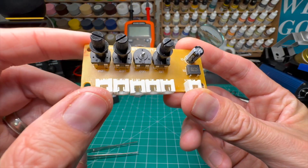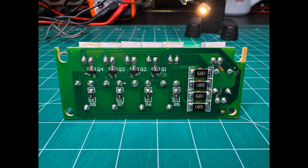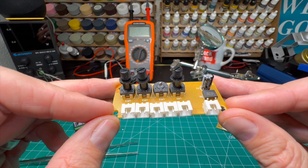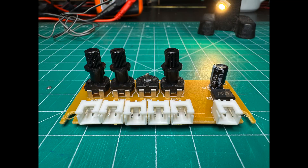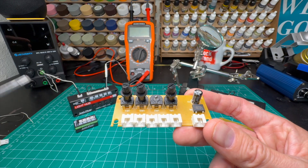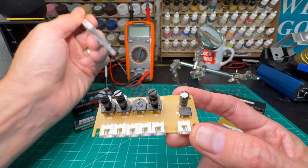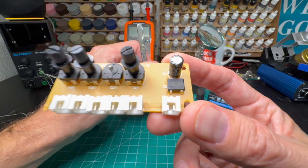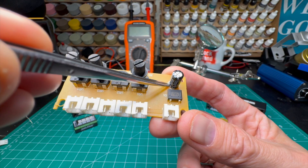Here's a look at the interior of a light hub. As you can see, this is a much more interesting board than that extremely simple expansion hub — and for good reason. These are meant to be essentially bulletproof where it's impossible to burn out an LED. It also contains control potentiometers so you can adjust on an individual basis the amount of current coming through these ports to the LEDs. The input for this board is going to be 12 to 24 volts DC. You notice there's a bridge rectifier here as well as a capacitor.